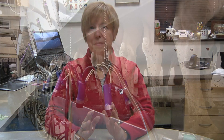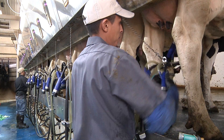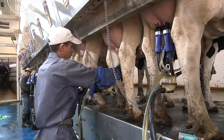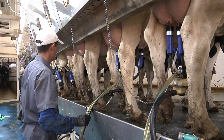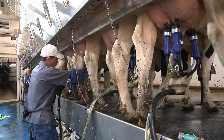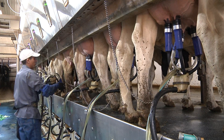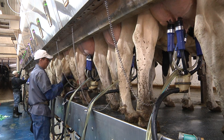There are different ways we attach milking units depending on the configuration of the milking parlor. In a herringbone milking parlor, the claw outlet should be aligned and pointed at the head of the cow. In a parallel milking parlor, the claw outlet comes out between the legs, and in most instances we need some sort of device on the long milk hose to properly align the unit so it hangs square on the udder. In a stall barn, the long milk hose should hang behind the shoulder of the cow.